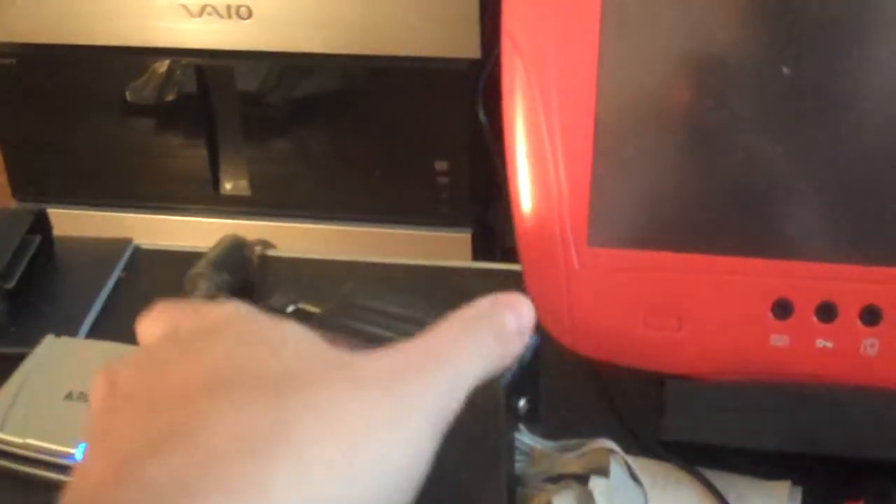Before I go here, you'll see that I have in my cartridge slot here a curious-looking cartridge with a USB port. There she is, the USB interface. Just took and sawed a hole in this cartridge so that the USB port would pop out. It's using an SL811 host controller that's wired directly into the bus. And now I just need to write some drivers for it — maybe a day or so.